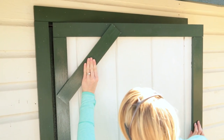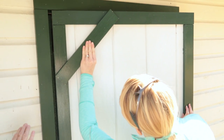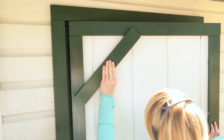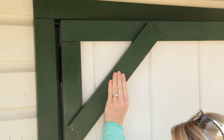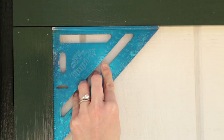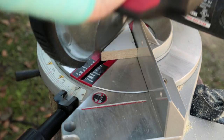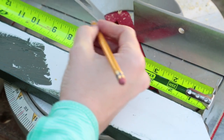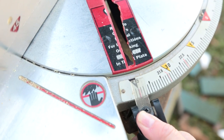We're using scrap material to find the placement for the decorative angled accent pieces. After trying a few positions, we decide to use the speed square as a template for our measurements. These accent pieces will really add some character to this door. Once we're happy with the measurement for the first one, we cut the same opposing 45-degree miter cuts for each piece — six in all.